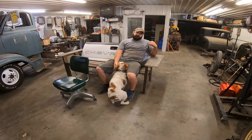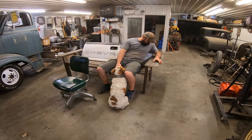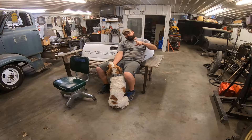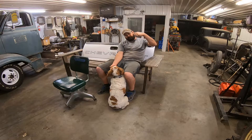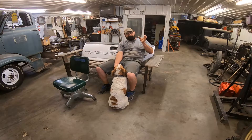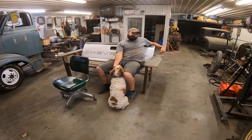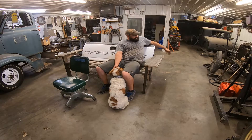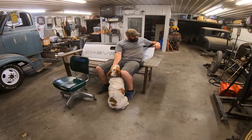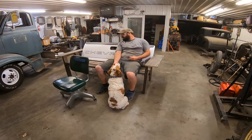I didn't know how to tie the tailgate to that board or to this board sitting by my butt. So down at the bottom I used some flat strap I had laying around — it was actually angle strapping that we straightened out. Then I took a couple of floor joist hangers, cut a third off each one, bolted them to the existing 13-millimeter hex bolt on the side, kind of bent that angle, tied it into this 2x4 cross brace, and then made another piece of wood angle that goes from the cross brace down to the back leg. She's good and sturdy.